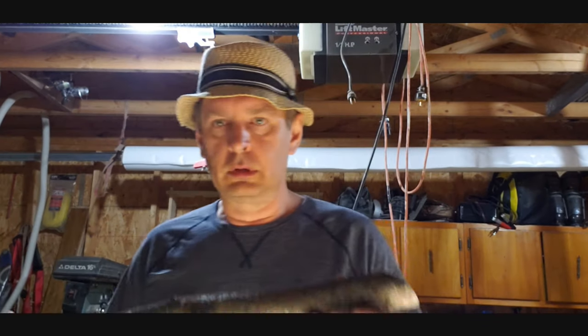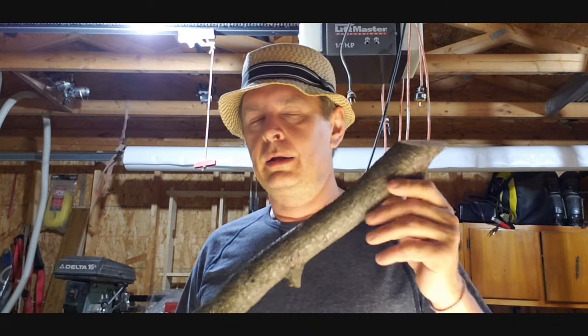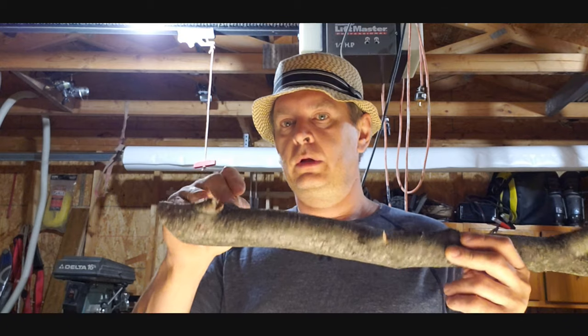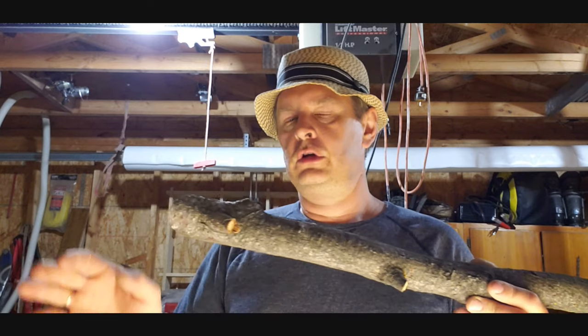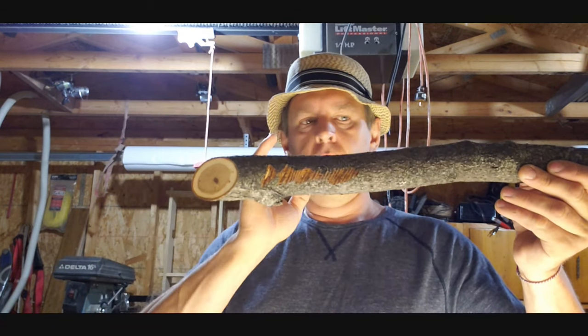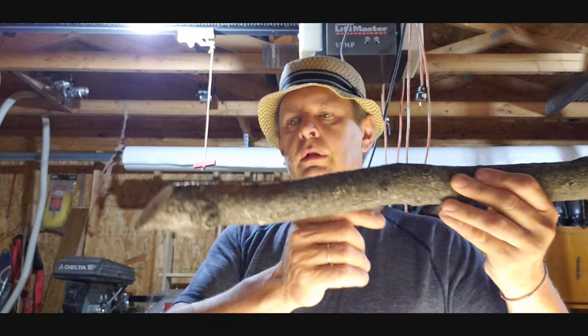First, when I look at the wood, for me, knots, I'm not trying to avoid them because I like the way they look when you work them out, but they're harder. If you're a beginner, I would prefer that you try not to use any knots, because when you're carving a knot, you're going to go from both directions. You cannot just carve it straight as you would with straight wood. In my case I would use this part definitely, but if you don't want to work too hard, cut it here. This knot though, it's not a big deal because it's going to be the handle.